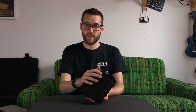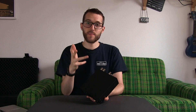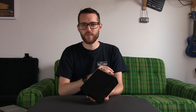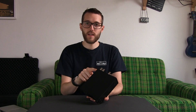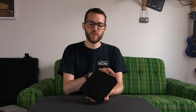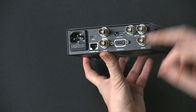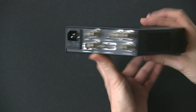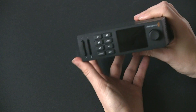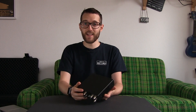Next up you have reference in and out, so you can sync a few of these devices together for digital signage and things like that. Next up we have the HDMI out — that's something I talked about last week which is a nice fix for the ATEM Television Studio HD. It only has program out over SDI, so what you can do is loop your signal through this and then use the HDMI out from this as your HDMI out of the program. Finally you have SDI in and then two SDI outputs. So that's pretty much a look at the device itself.